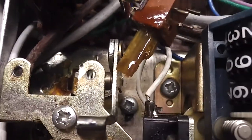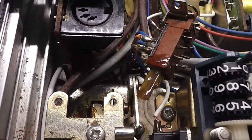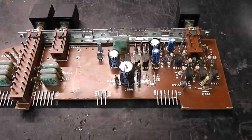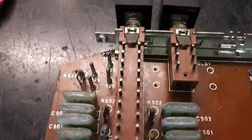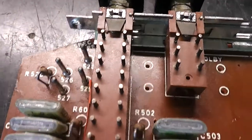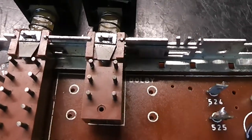I've just removed the pause control, and absolutely treacle - it's even thicker than treacle. It's hardly surprising the pause control was struggling to function. This is the amplifier 2 PCB I'm working on at the moment. You can see the chrome switch is on this side with various capacitors, resistors, and the Dolby switch. I've been flushing out the switches and getting a little bit of grease into the latch mechanisms - they feel much better now, and the mono switch is working correctly.